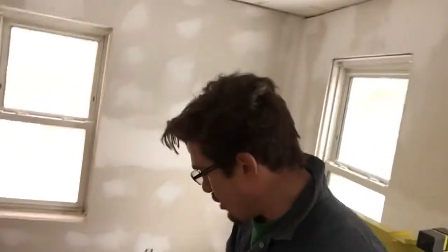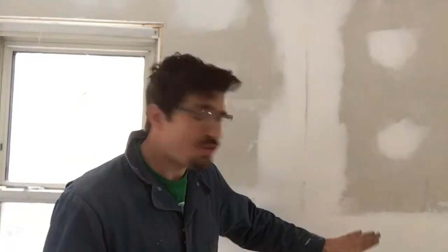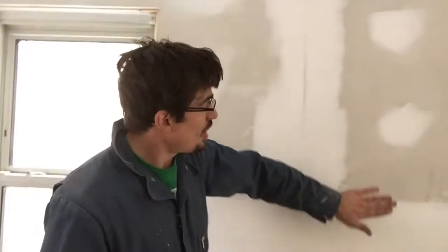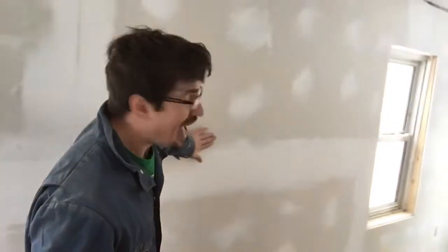We've gotten to our fourth level of plaster. Level four means all our seams and screw holes have been covered and sanded four times to bring it all to one level, nice and smooth. But that smoothness isn't consistent throughout because sanding between each layer roughs up the paper. You can paint at level four and a lot of people do, but you can tell the difference between the plaster smoothness and the paper. So we're going to go to level five — a skim coat, plastering the entire wall — then sand it and paint it.